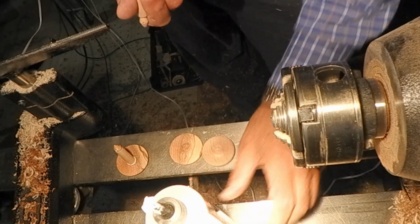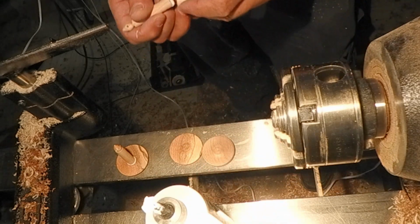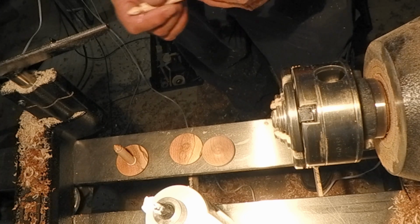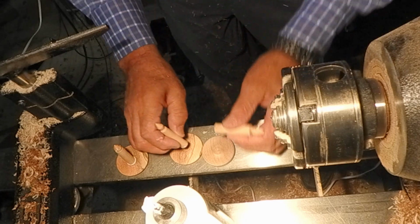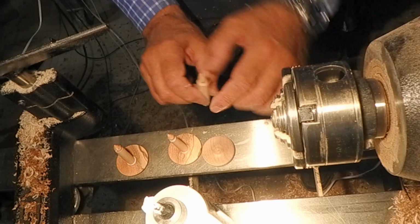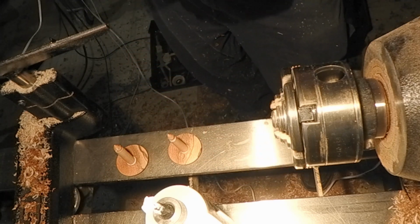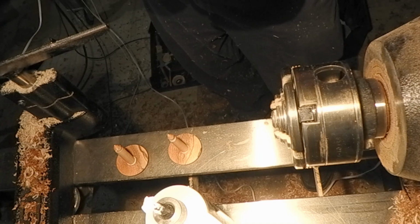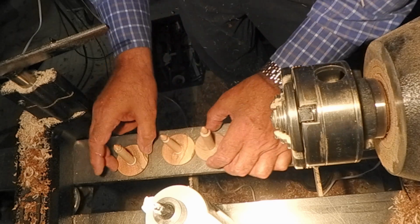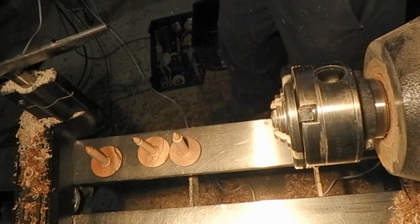And this Quick and Thick, I just discovered it here a couple of weeks ago, and I really like it because I know they say that glue is not supposed to take up any gaps, but Quick and Thick was designed for working with moldings and sometimes with little miters where you don't have an absolutely perfect fit, and the glue will actually fill the void a little bit, and it dries clear and it's paintable, and we're not worried about structure. So we'll just let these sit here for a while, and they'll set up a little bit.